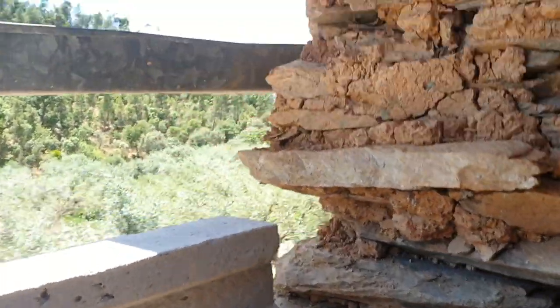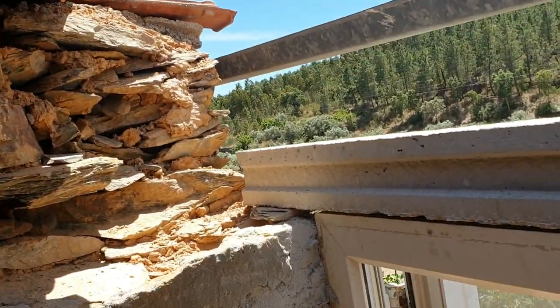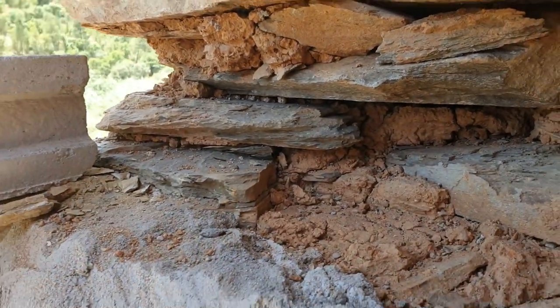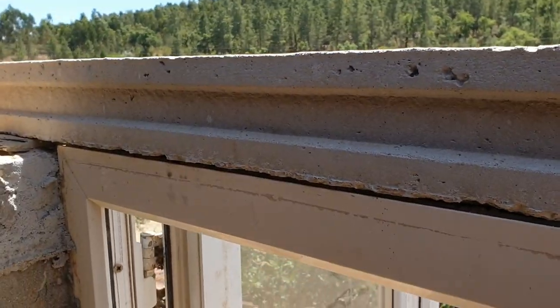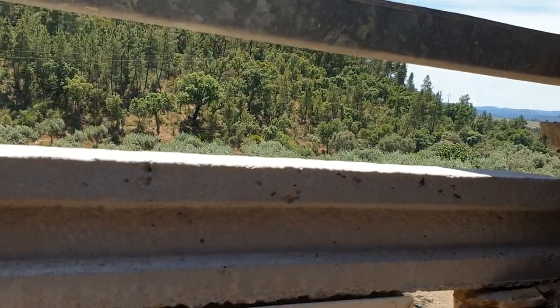Right, end of lecture — I must move on. That's got the first lintel in but there's going to be quite a lot of brickwork or stonework to do. I've got to do the stonework while I can get to it, because if I put all eight beams across where they've got to go eventually it'll trap me getting to it. So I think I'm going to have to work backwards with it. I might still have to go outside at some point, but it's about blocking the hole up really. Now I've got the door on I want to block this whole lot tonight so that when it gets drafty we won't be letting too many insects and bats and birds in.